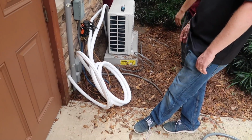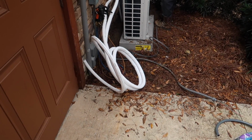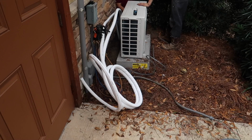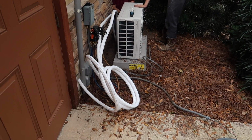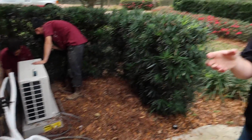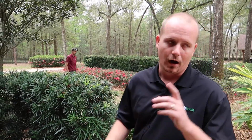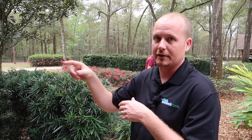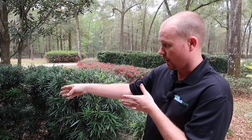And wait, so let me think about this. So we have both lines are boiling, so both lines are vapor? No. So in the other one, you have the big line, which is fully vapor. It's cold, fully vapor. And here, the big line, cold, fully vapor. They're the same. They're both suction lines. They're both coming back. On this system, the line that's leaving is fully liquid, and so it's warm. It hasn't been restricted yet. It hasn't had a pressure drop yet. Okay. All right? In this system, the pressure drop happens outside.